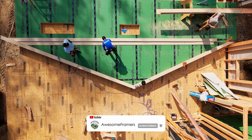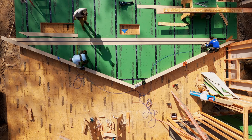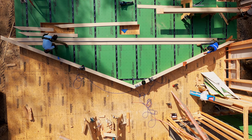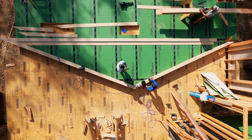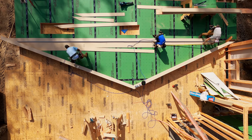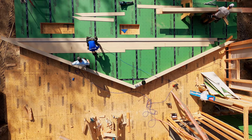Now, it's time to side the gable, and spoiler, this only took 20 minutes. So Kyle's cutting in place. He's basically keeping track of what Shane and I need as we nail. See how he's staying ahead of us? Shane and I, in the meantime, are gonna snap top lines all the way across. That way, it takes like 5 minutes. That way we're not pulling out our tape measure except to take some random lengths here and there, but it also allows us to line up that SmartSide 16-foot siding and keep it perfectly straight.